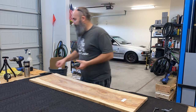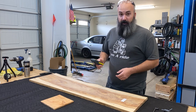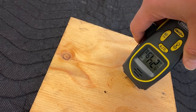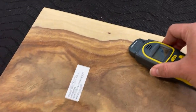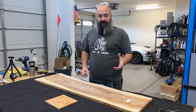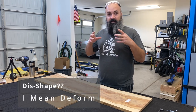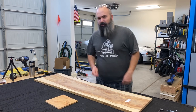I use it with my other business in real estate, checking for moisture problems and all sorts of other areas. I have this piece of plywood that I pre-soaked yesterday — you can see it's reading 25% on the points — and let's check our wood: zero. So when they say kiln dried, they mean kiln dried. What happens as moisture dries out of wood is it will begin to twist and misshape itself.